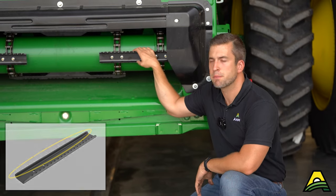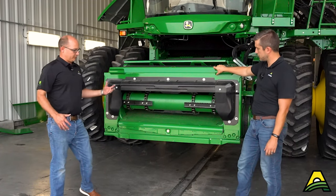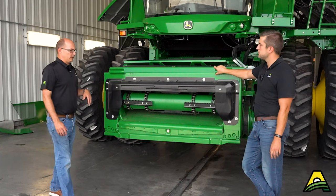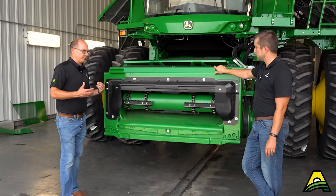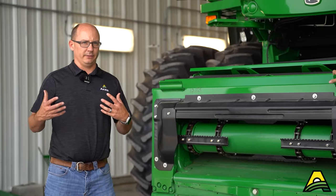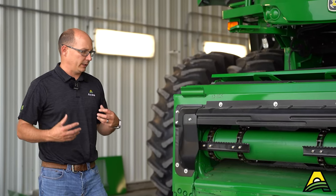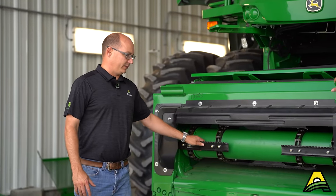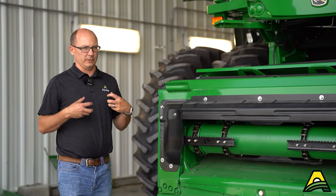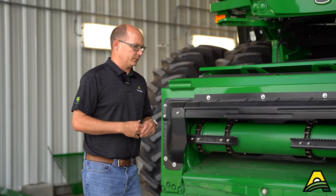If it's not set up that way, it might be worth your time to flip that over pre-harvest. And if you're having small issues in small grain or tough soybeans with feeding issues — we see it quite commonly in aftermarket heads — sometimes simply flipping these bars so they're more aggressive will help grab those soybeans and that material more aggressively, fixing some of those feeding issues.